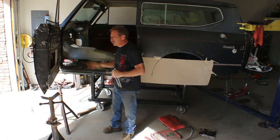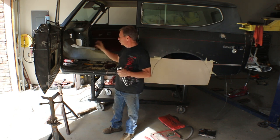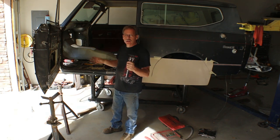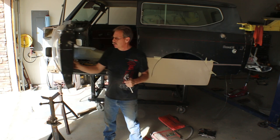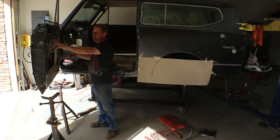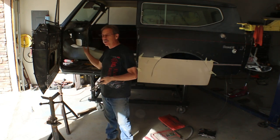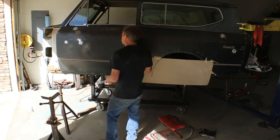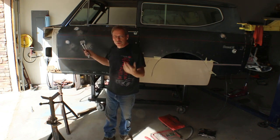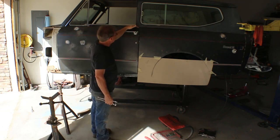Now, something I could tell you about hinges and adjusting them is on most Chevrolets and Fords, you can get away with leaving one of the bolts loose, so you're just tightening two. Don't use an impact. Take the time, do it by hand to get everything snug and tight. You'll eventually just ruin the bolts with an impact. On the International, there's one bolt deep down inside this A-pillar. It takes a long extension. If that bolt doesn't get tightened each time, you never get the adjustment quite right. So you end up tightening and releasing all three bolts on each hinge every time.